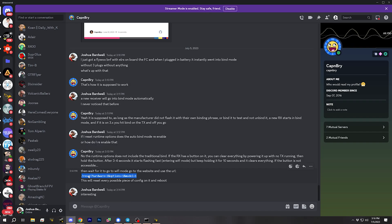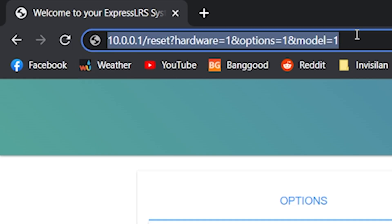The other thing that you might want to know is that if you want to reset that functionality — for example, let's say you're about to sell a quadcopter with an ExpressLRS receiver in it and you want to completely reset the receiver back to factory defaults — the way to do that is to grab this little text string and put it right here in the URL bar of your receiver and load that URL, and it will reset everything. Then it'll go back into binding mode automatically. That's pretty freaking cool. I didn't know that, and I'm going to bet that a lot of you didn't know that either.